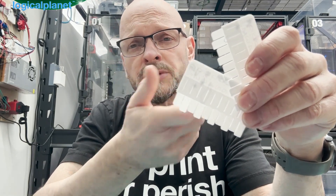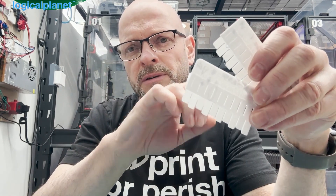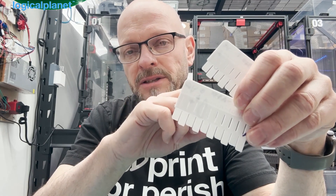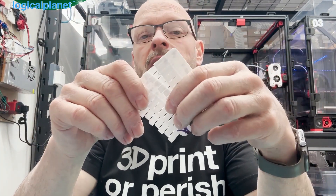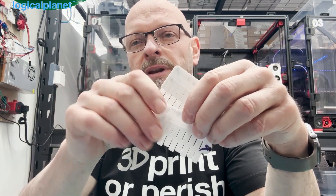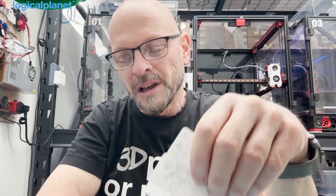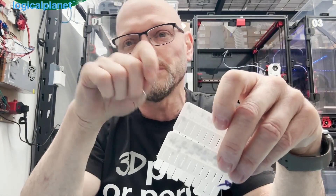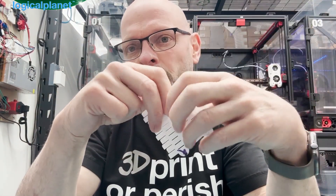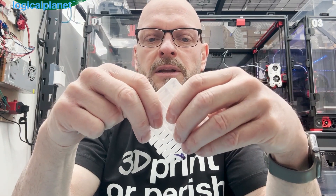I was squishing the material too much, getting flare-out, and compensating for the flare-out with a chamfer on the design. The real problem is that when I printed a 0.2 millimeter layer height, I wasn't actually producing a 0.2 millimeter thickness in the first layer. Compressing too much ripples through the next five layers or so, and it's so invisible it's easy to miss. All the printers I was running had squish up around 0.4 millimeter — meaning a 0.2 millimeter flare-out on each side — almost invisible in the finished print, but negatively affecting quality.